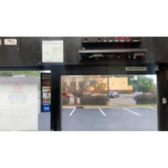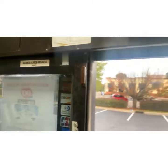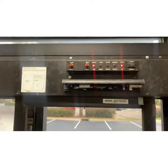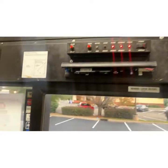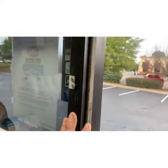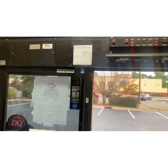It's dragging much less now. Do you see that little hiccup? That's where the motor dragged. This unit is from 2005 — I'm not sure whether that's the window itself or the opening unit, and there's no way to denote that. I'm actually going to open it up and get a part number off the motor because I'd suggest replacing it if you really want this to work long term. It got hung up again.